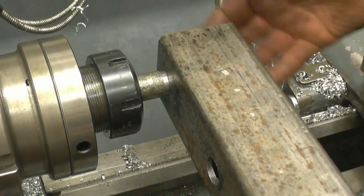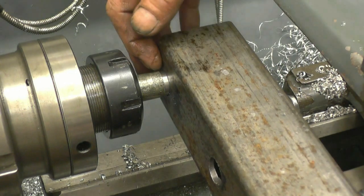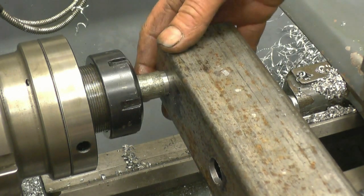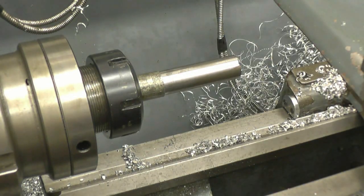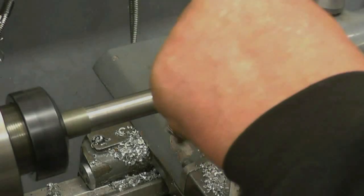Touch that spot so it goes into there. Cut off flush and just tack weld it on the bottom. All we want now is a 12mm hole putting through it.